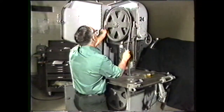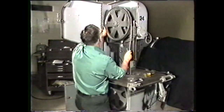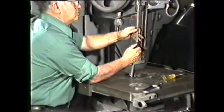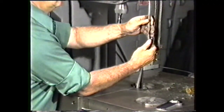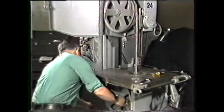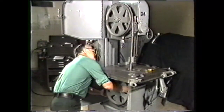Place the file band over the upper band wheel and lock the ends together by slotting the rivet head in the slot and aligning the band. You also have the option of joining the ends of the file band while it is on a table. However, be careful when using this method not to kink the band, which would make it unusable.